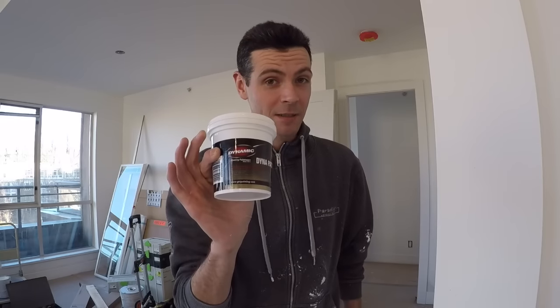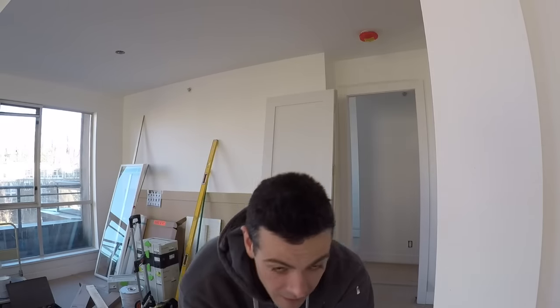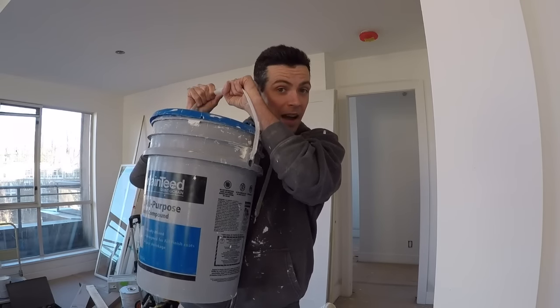That's how I like to fix it when my miters are a little bit open. As they say, a little caulk and a little paint makes a carpenter what he ain't — but in this case it's spackle. And for those of you from the east coast of the US who like to call joint compound spackle: no, this is spackle for filling little things. That is drywall mud, not spackle. Anyway, I hope you found this video useful. Thanks for watching Vancouver Carpenter, and until the next video — if you want to help out the channel, you can like and subscribe. Thanks for watching!